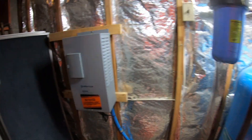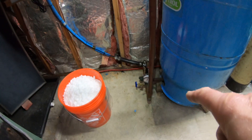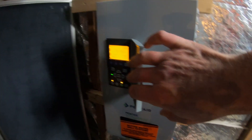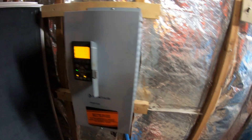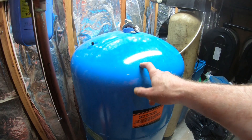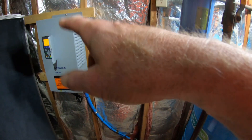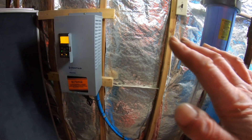I'm going to change the pressure on a Pentair IntelliDrive. Right now it's set for 60 PSI constant — what it is right now is 58, so it fluctuates a couple of percent. What you have to do is empty this out, and the air pressure inside has to be 70 percent of the final number that you want — so 70 percent of the final target PSI.